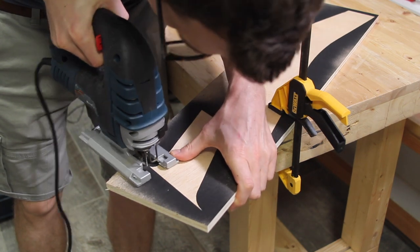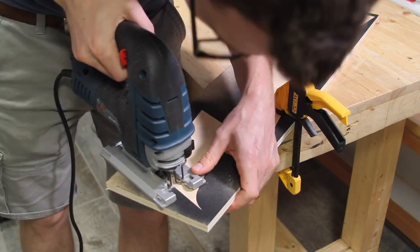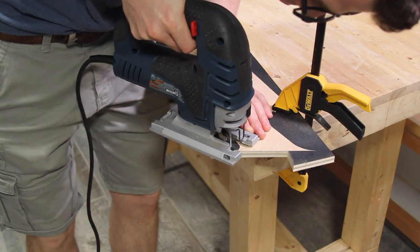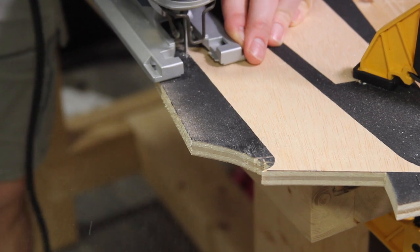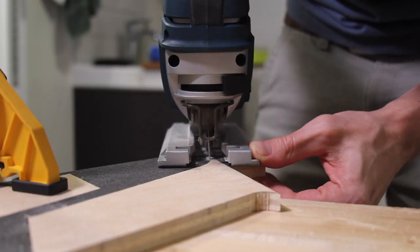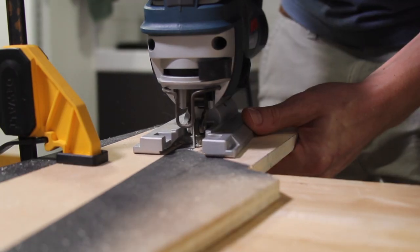Having a bandsaw would be ideal for cutting these out, but I don't have one, so I used my jigsaw instead. It's a bit easier if you use ¼ inch MDF since it's a little thinner and easier to sculpt with a file for those corner pieces. You can see that I left some extra wood in a few places to reinforce smaller areas of the curves — this won't matter because I'm only using the templates for the vertical pieces of the legs, which have the curves.